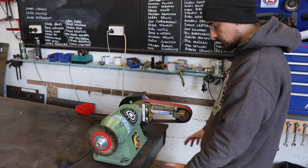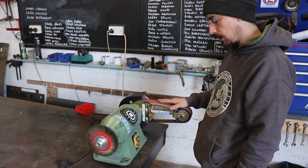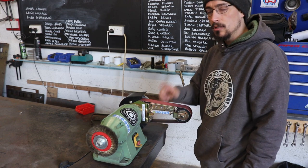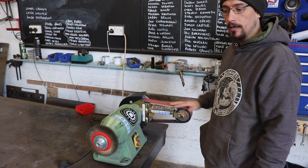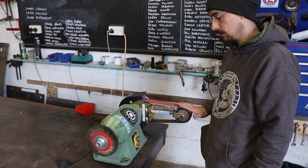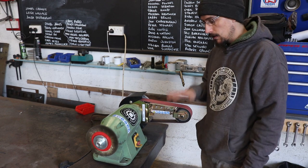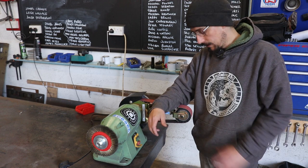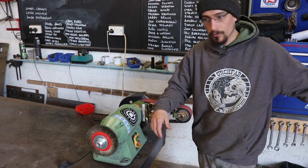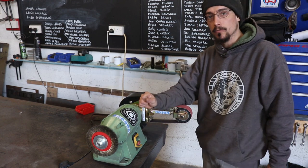Simple floor-mounted stand, two plates on it. I'm going to cut it all out on the CNC plasma and I'm going to weld it together using the pulse-MIG function, just because my welder can do it and it's something I don't ever use, so I thought I would make use of it. I'm going to bolt it in the corner so the dust from it is sort of contained to the corner and not just flung all over my table.